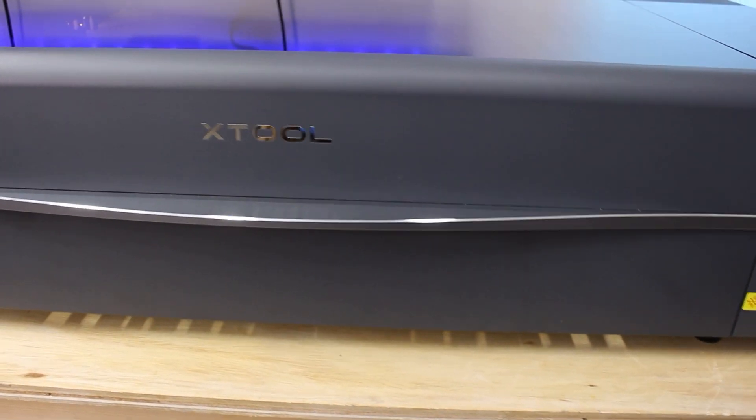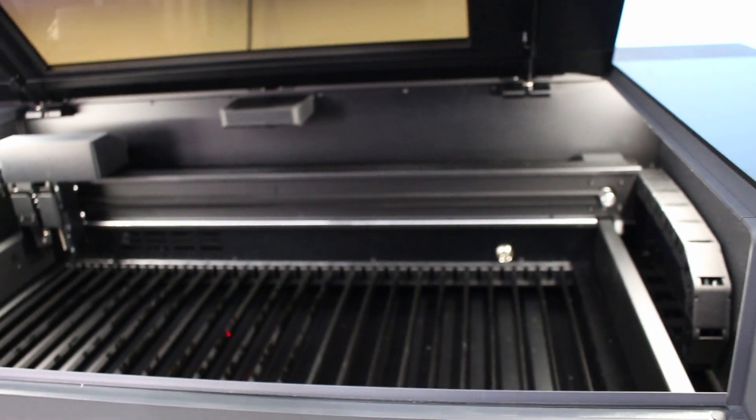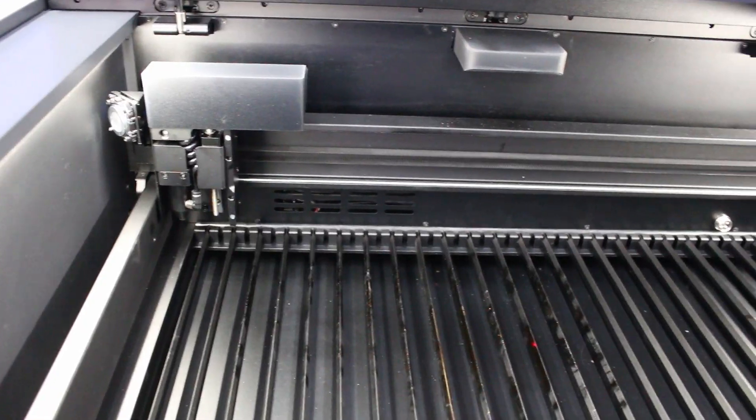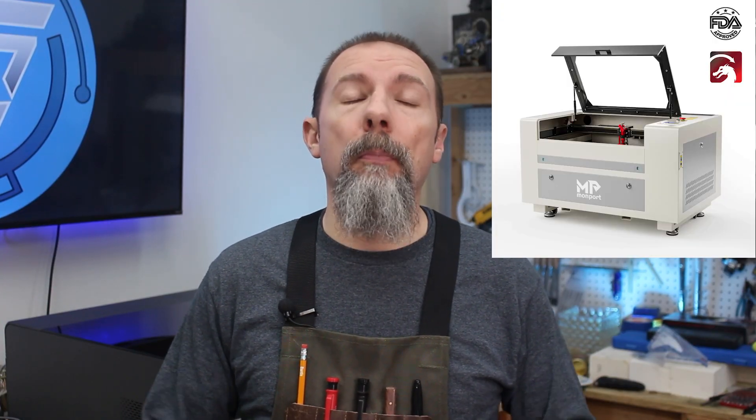Unless you only plan to cut or engrave very small pieces, you will quickly outgrow a K40. Over here I have my Xtool P2 desktop CO2 laser. It has a working area of 23 inches by 12 inches, or 58 by 30 centimeters. I'll leave links in the description to videos where I use all the different lasers I mention in this video. Even this laser is on the small side in terms of working area. The Xtool P2 is a competitor to the Glowforge — I do not recommend Glowforge because it's all proprietary and you're locked into using their software, and they're also more expensive. You get more bang for your buck with a non-Glowforge CO2 laser. These types of CO2 lasers are meant to be smaller and not take up as much space as floor-standing CO2 lasers, and the trade-off is a smaller working area on a desktop CO2 laser. There are also floor-standing CO2 lasers with much larger working spaces.